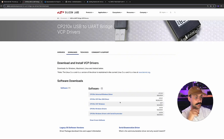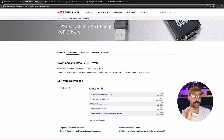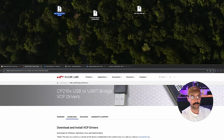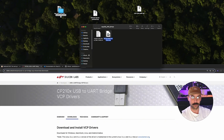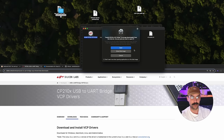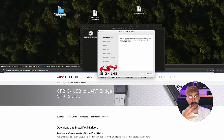First step is installing some drivers so we can connect to the ESP32. If you've never used an ESP32 before you'll need the CP210X drivers — I'll have the link in the description. Download the appropriate version for your operating system, unzip the file, run the DMG or executable, go through the installer, and you'll be ready to move on.